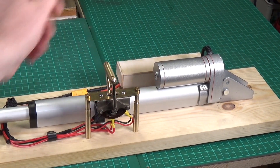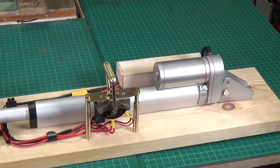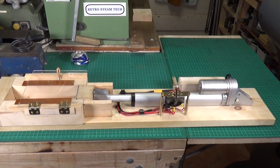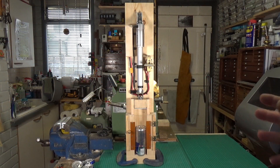We've got the battery box over here with an 11.1 volt LiPo battery — more than adequate. I found this lovely old toggle switch on eBay which is a double pole double throw center-off, wired up as a simple crossover so it reverses the polarity on the ram. I powered it from a bench supply to measure the current — at maximum resistance, as you get towards the end of crushing the can, the ram draws about an amp, which isn't much at all. The LiPo battery will be more than equipped for that since it's only going to be used once or twice a day.